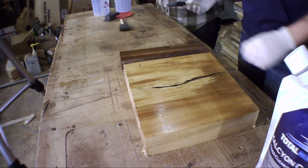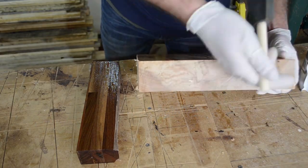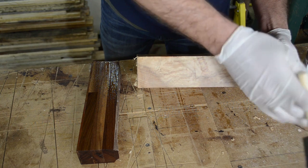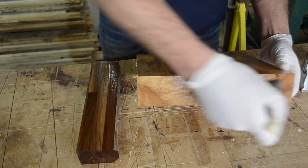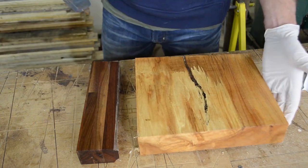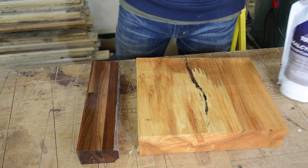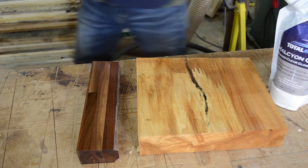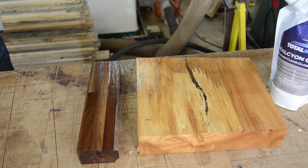You do not need to sand between coats, which, in my opinion, is one of the most painstaking processes on larger projects, getting all the sanding done and then getting all of the sanding residue off before applying yet another coat. So it is really easy just to go in there and keep applying coats. And then you'll do a final sanding at the very end, which we'll show a little bit later, just to smooth out your surfaces. This is compatible with 1- and 2-part varnishes. And it does come in a clear gloss and a clear amber gloss, which we will show both.